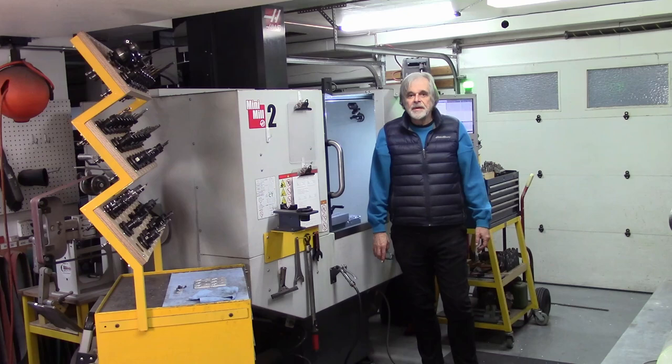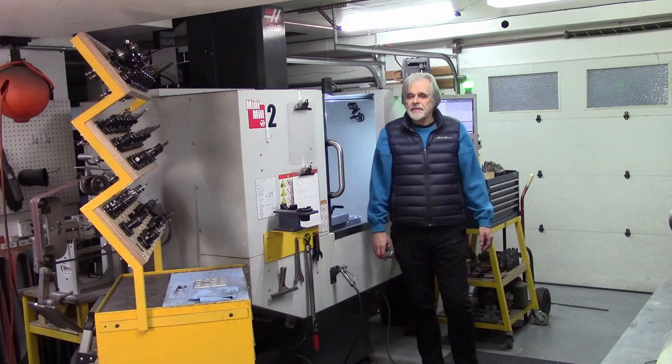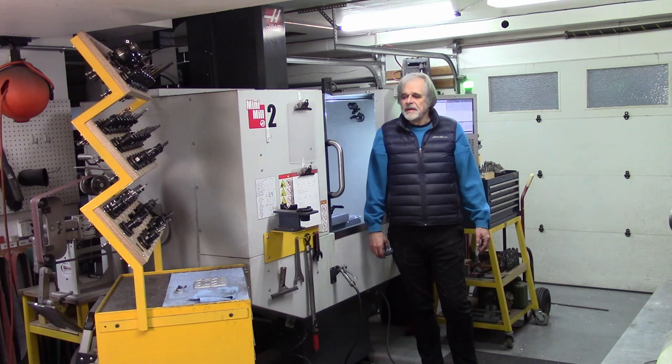And so screwing things down with a screw is no problem. It doesn't bother me if the screw leaves a tiny little scar on the surface. But since this is a somewhat artsy-fartsy piece, I'm making a fixture that has a protruding part that fits the inside that I just milled, and it fits really accurately. So I'm taking the exact same tool path, the same CAD drawing outline that I used to cut the pocket, the recess, and using that to cut a protruding island.